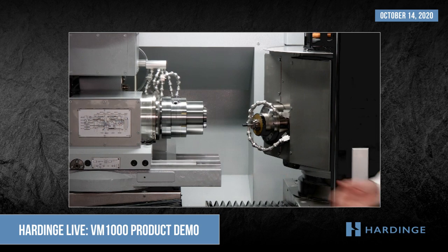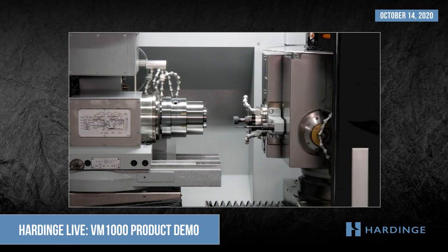The internal grinding spindles are oil-air lubricated high-frequency spindles. They have a speed up to 120,000 RPM. In addition, the internal grinding spindles are available with cooling lubricant through the spindle. The tactile measuring head is mounted to the turret wheel head. It's used to measure the diameter and length, the workpiece position in Z and C axis, and for many other measuring operations. My colleague will now explain the workpiece carrier to you.